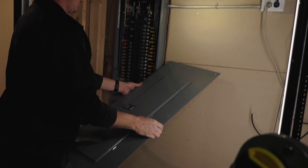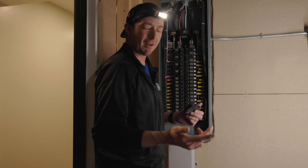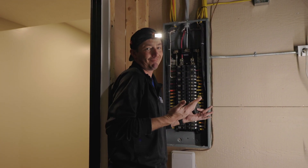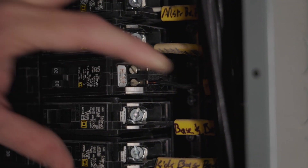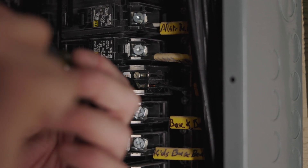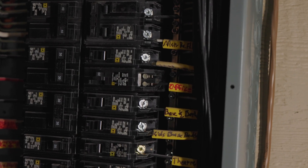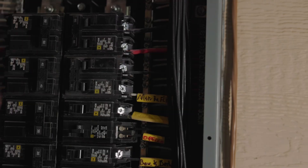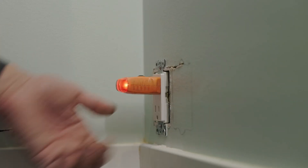I'm adding a tandem breaker because I'm out of room. That means it's two breakers in one slot. I didn't label the panel because I've never put this panel cover on — it's my house. These tandems take a small flat head. You still want to get that torque in there, make sure it's nice and tight. Now that one can be turned back on. I didn't make a tag for that circuit, so I'm going to do that now. She's done — that outlet should have power. Let's go check it. Good to go.